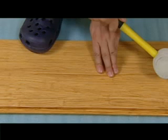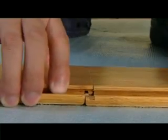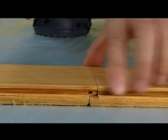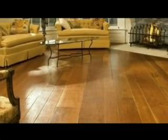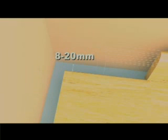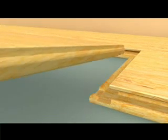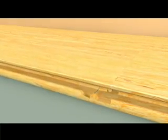When you've finished one row of panels and proceed to a new row, please make sure up hooks and low hooks are completely engaged with each other, and locking function is activated. 4. For big room area, expansion space should be enlarged accordingly from 8 to 10 mm standard, and 2 cm thick baseboard is recommended. This is particularly important for solid wooden flooring. 5. While tapping, always make sure that the two panels are in the same level and in full touch with the ground.